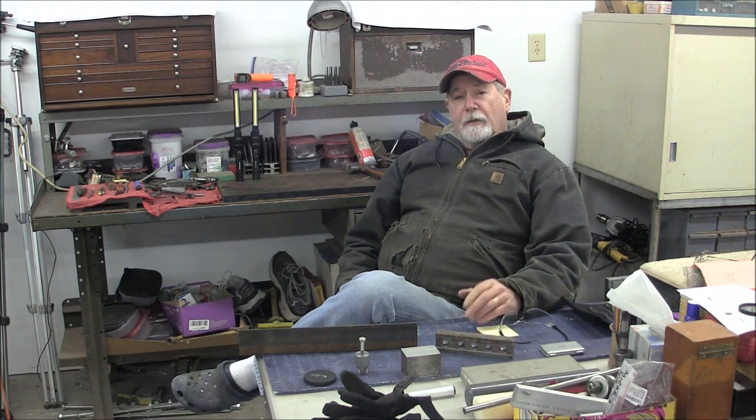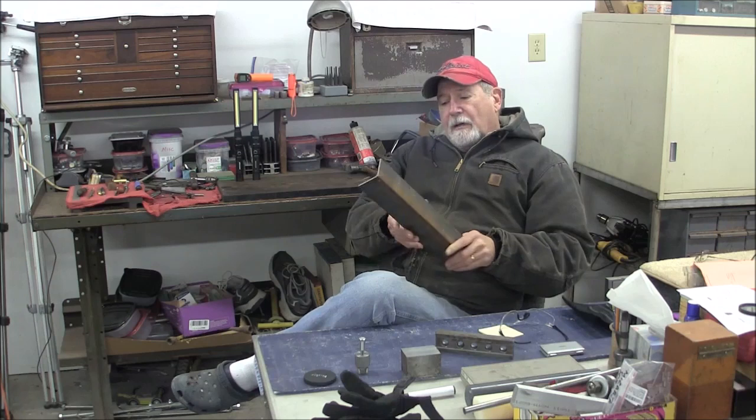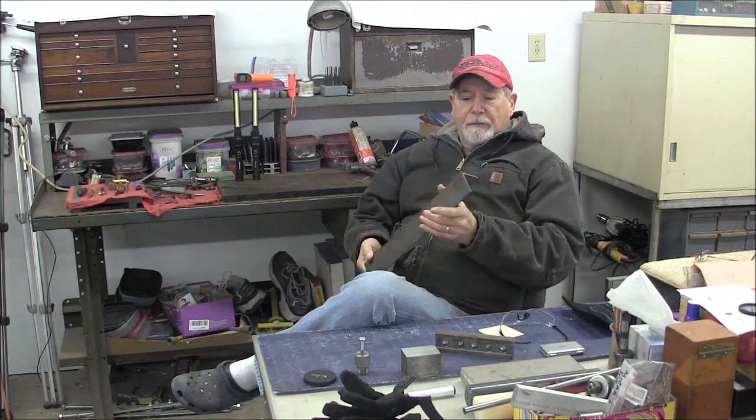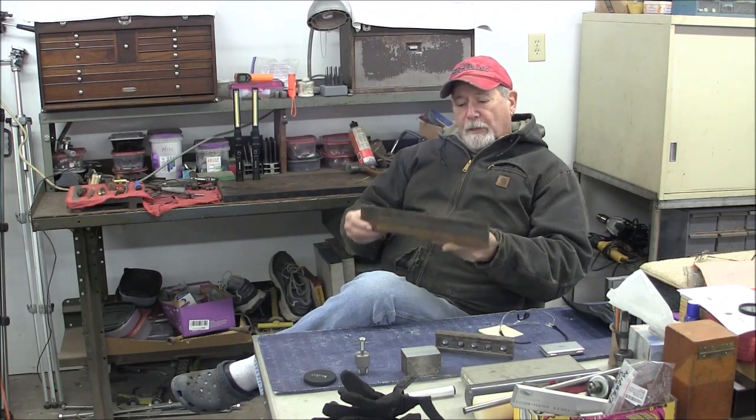If you've followed my last videos, I've been working on the surface grinder refurbishment, and that's complete now. In my last video, I ground in the chuck, and judging by the finish, I have no reason to believe that it's not nice and flat. But in this video, I want to throw an indicator up there and check the total indicated reading on the top of the chuck, and we'll put that on film for you to see. I want to make a back rail for it. I'm looking for a piece of angle iron like this. This one was a little bit short, but if I can find one long enough, I'll cut the tail off, and we'll make a back rail for it.